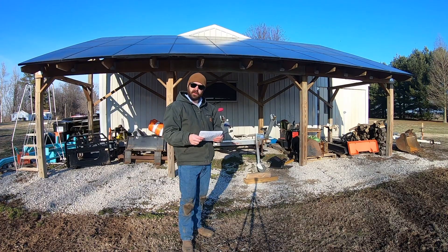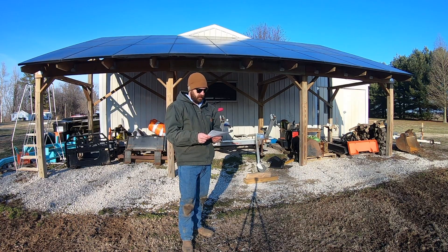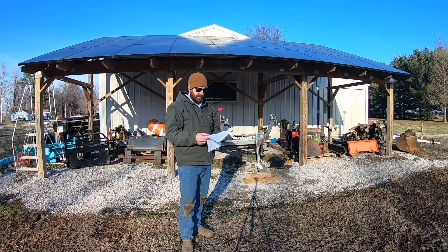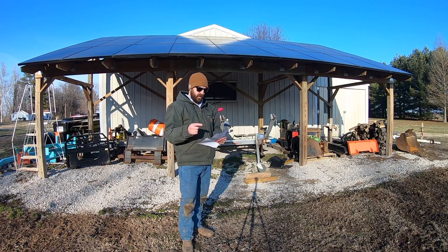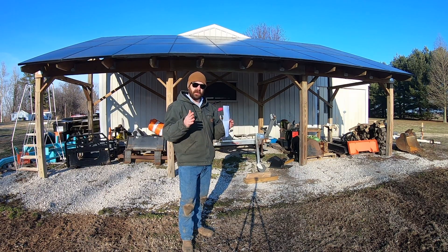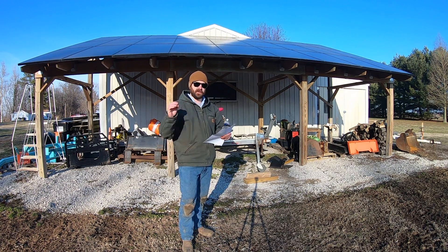Real quick — power on the fiscal year. So again, this is September 1st to August 31st. The first year I had it in service, I made 11,172 kilowatt hours. The second year I made 11,108 kilowatt hours. So that's a difference of only 63 kilowatt hours. Year two made 63 kilowatt hours less than the year prior. That's really good — that shows almost zero panel degradation. I don't know what percent of difference that is, but it's negligible.